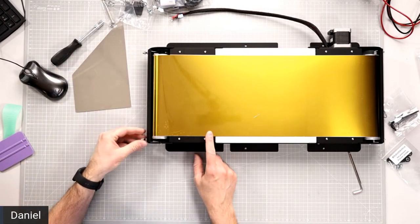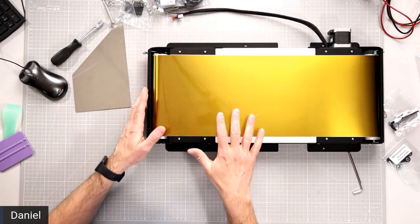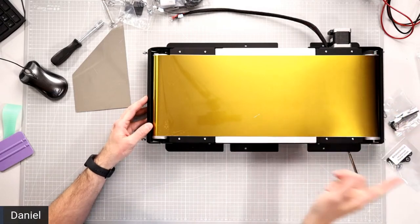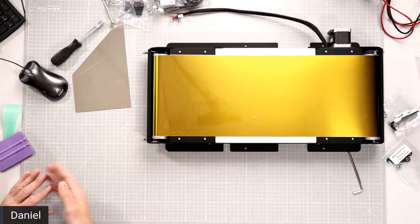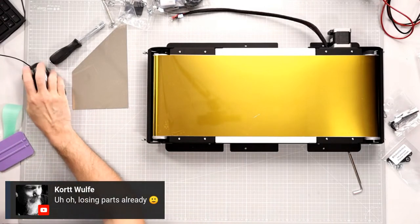when the belt isn't perfectly straight, so if this side is more tensioned than the other side, the belt is slowly going to shift in one or the other direction. So if it runs, then you will see it moving, right? It's gonna move slightly towards this direction, or slightly towards that direction when you run it multiple times, and then you can adjust the tensioning so it's really straight and then it doesn't shift anymore. And I guess that probably over time you will have to readjust this. So what kind of screw did I lose? I can see it. Okay, so I'll get it later. Yeah, that's what happens sometimes.